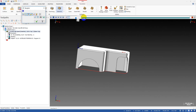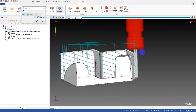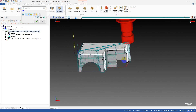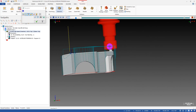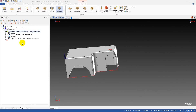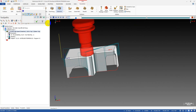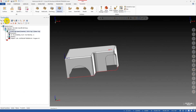Okay, it's done, let's see what we have. You can see we have now eliminated the air cutting moves here and here. There are many retractions because we selected climb milling as the strategy, so the tool retracts many times. Climb milling mostly provides a better surface finish, but if you don't want so many retracts you can change to the zigzag motion.